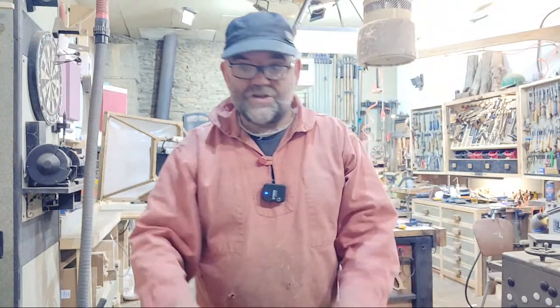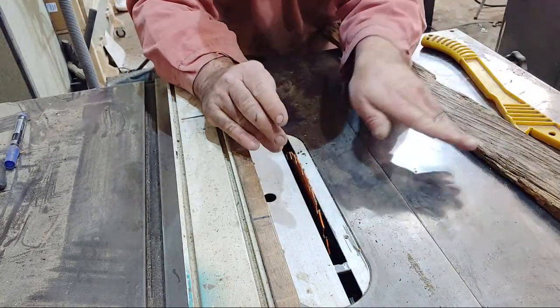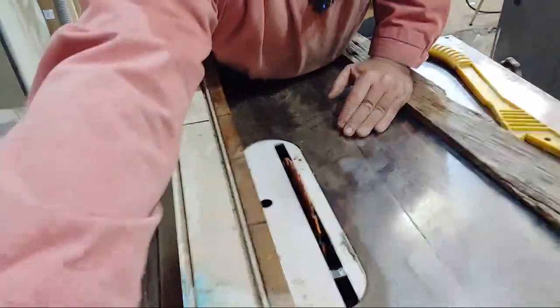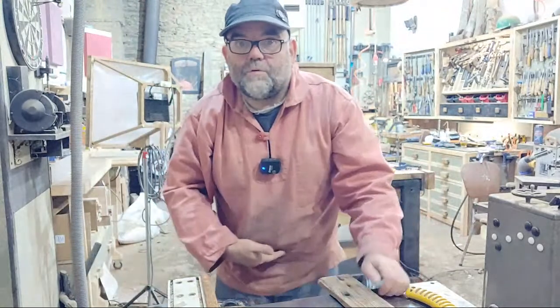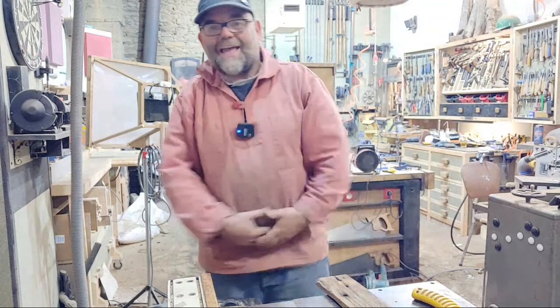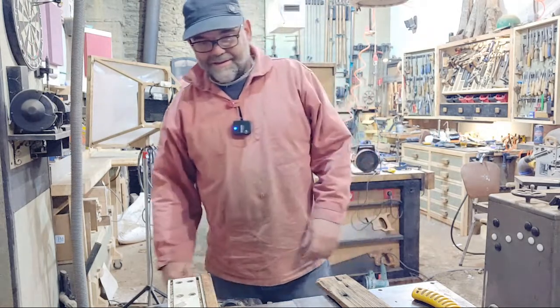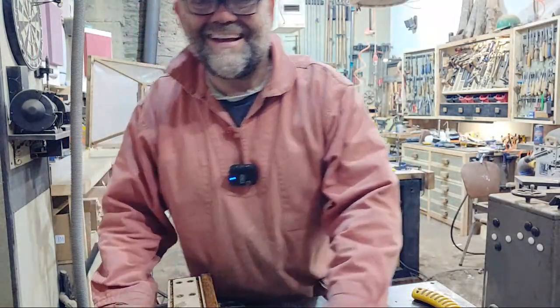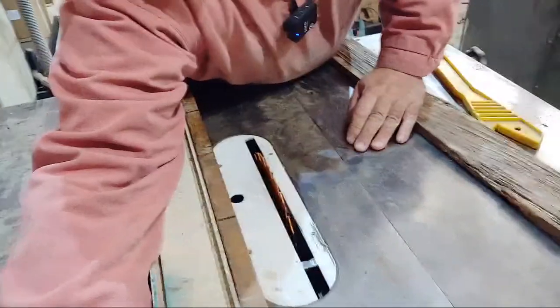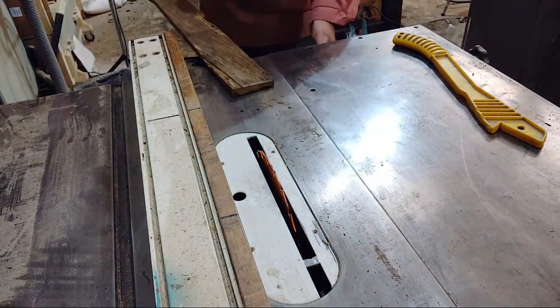Above the plywood. And what happened is, the square plywood that I was cutting rode up over the top of the blade, spun round like that, and hit my belly. All I had was a t-shirt on, and I could feel it. Oh my God, what have I done? I didn't want to look down at first. I thought to myself, oh my guts are all hanging out. But no, I just bruised myself. I thought, God, that hurt. And I was black right across here, completely black and really badly grazed with a piece of plywood. Not great. So I didn't make that mistake again. That's painful. I carried on working. I still finished. It was a few days before Christmas Day, so I had to get it finished.